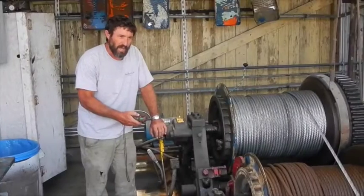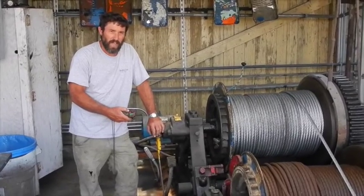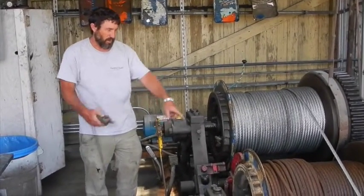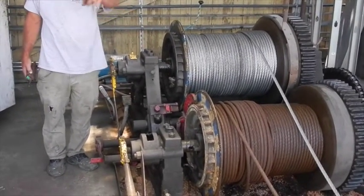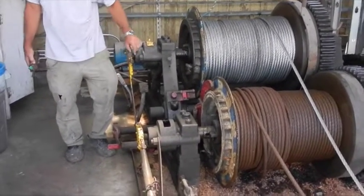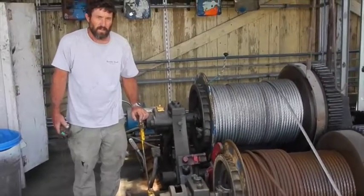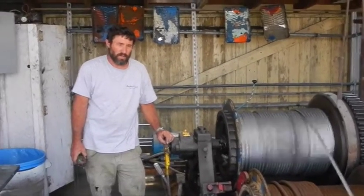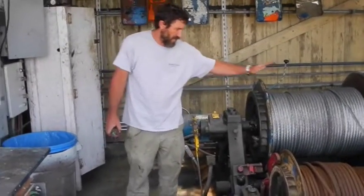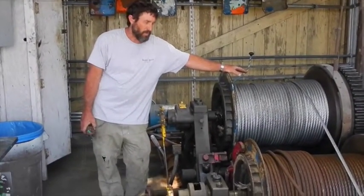Now, if we were launching a boat or running a cradle off the flat onto the slope so that it can go down by gravity, first we must reel in the wire on the secondary drum that goes through a turning block at the beach head of the ways. By doing so, it will start to pull the wire and pull the cradle down the ways. As it does that, the slack will be drawn out from the primary drum.